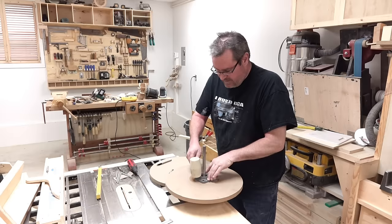Instead, I'll be making a flat dolly with a short piece of log to sit on, and that'll roll through, be caught on the blade, and then I'll just lift that up by stacking boards either underneath the casters that the dolly will roll on or by stacking underneath the piece of wood itself. The main advantage to doing it that way is it's less complex. Also, I can make the frame very stiff without a lot of work.